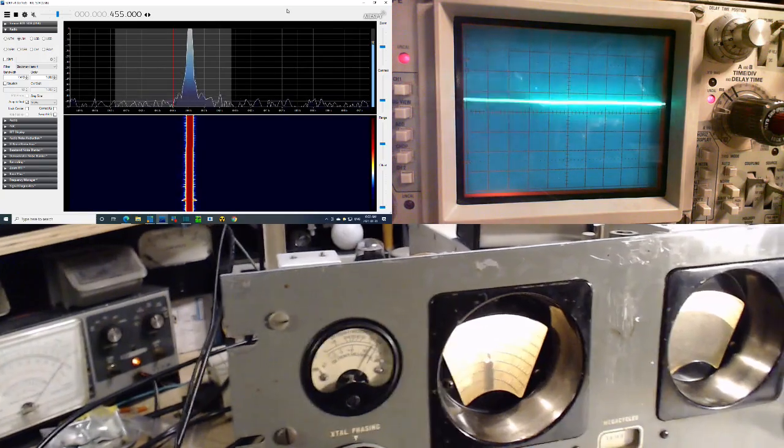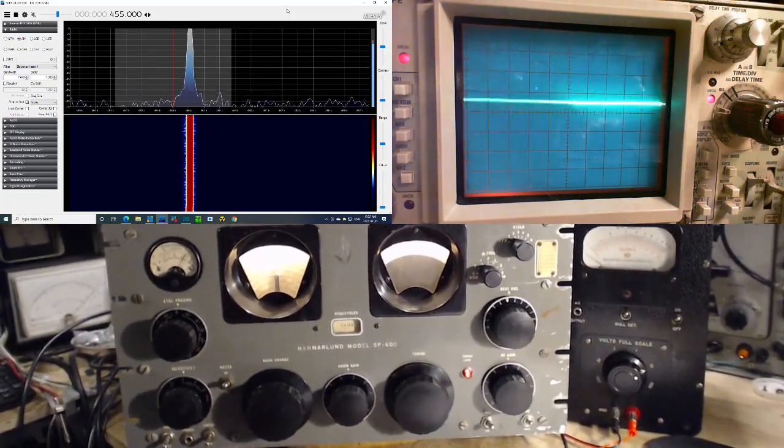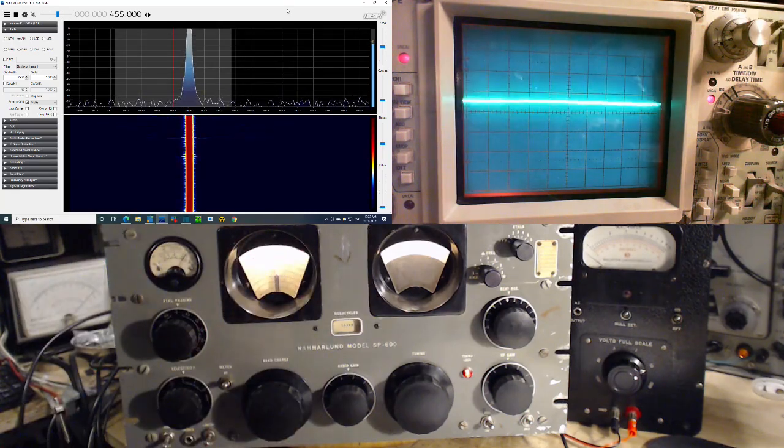Great. Now I just have to make sure that number is pounded in my head. So 80,000 microvolts is the same as, let's say, 100 millivolts. So 0.1 volts. So at 0.1 volts on the antenna, this thing's coming up to 100. Something like that. In normal operation on my antennas, this has not gotten to 100, but maybe now after being aligned, it might. Maybe not down here in the shop because of the length of the lead-in.